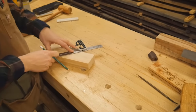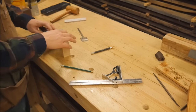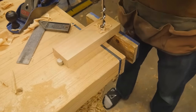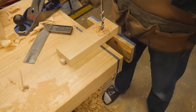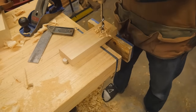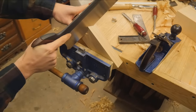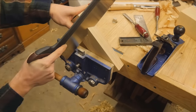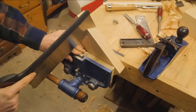Now the bed for this iron is tricky because it's at 45 degrees like most irons, but because it's skewed there's also a 30-degree angle set into it, so all of the cuts and marks are compound. After marking out where I want the bed to be, I'll start with an auger to begin removing the space for where the chips will come out, then use a handsaw to cut the compound angle down into that hole — this will be the start of the bed for the iron.